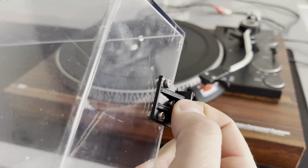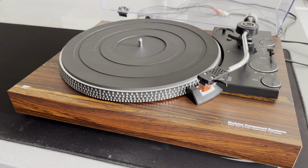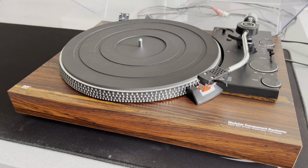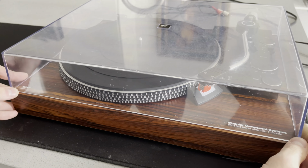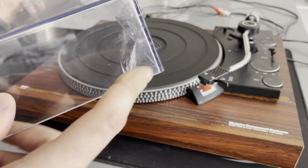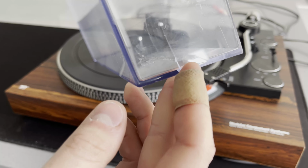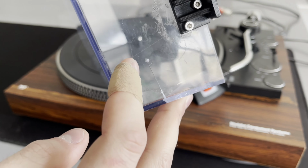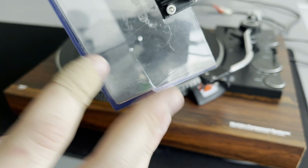It's very solid on this now. And it's so much smoother too. I feel a lot better about this fix than the epoxy one. I don't really know why I avoided doing this from the start. And then also throughout all of me messing with this lid, the crack started spreading around to the back, and so I did end up drilling a little hole. It's a 1/16 inch hole right at the edge of where the crack was, so hopefully that should stop it from spreading any further.